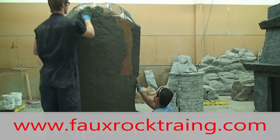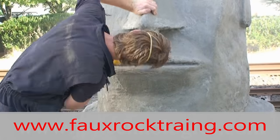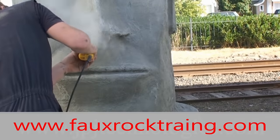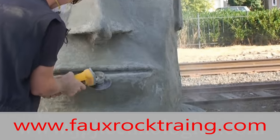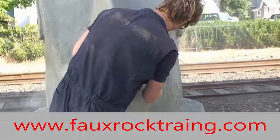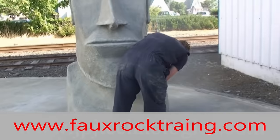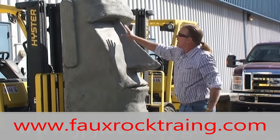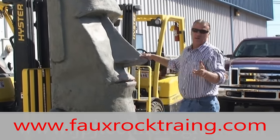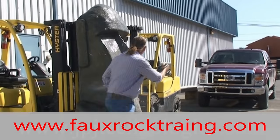Skyler is out there grinding the fiber down because it's so hairy — to knock it down. You could have done that when you were mudding it, and it should have been done. At the same time, grinding is often done for aesthetic purposes, to bring into shape what should already be there. Now we're going to wash it down in preparation for doing the texture coat. This was the structural coat that we just did.